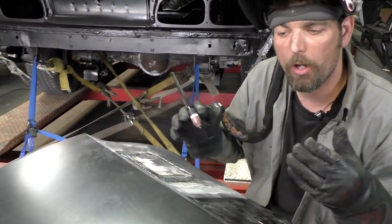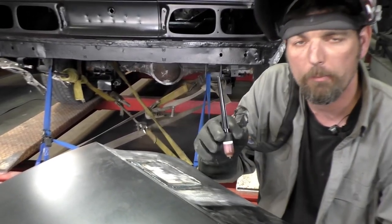We're doing a time lapse — I want you to notice the arc: that's what I was saying about the 30-degree tip, how narrow and focused the arc is. We're going to show a clip with a 60-degree arc to compare. Here's the video with the 60-degree cut on the tungsten — we're doing the front fender patch. You can see how much wider the cone is. Back on the 30-degree tip — you can see how focused it is. What I was saying earlier: I'm pretty much walking the torch into the filler, and as soon as it sucks the end of the filler in I'm pulling the filler out of the way. You want to go low with the filler and let it pull up — don't come in from the top and let the filler drip down; it should be sucking right into that crack. It takes a little bit of rhythm but once you get it, it won't be too bad.